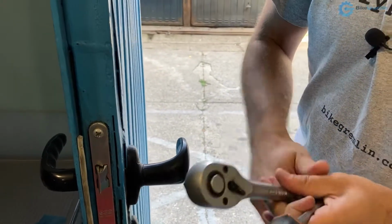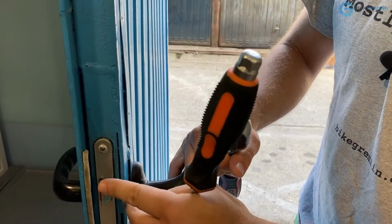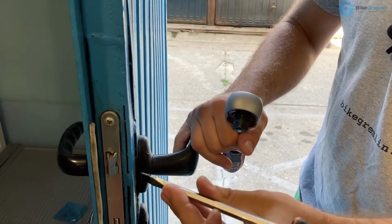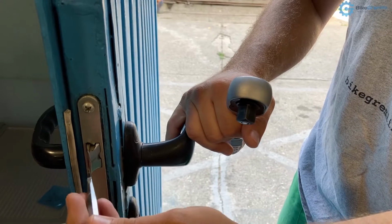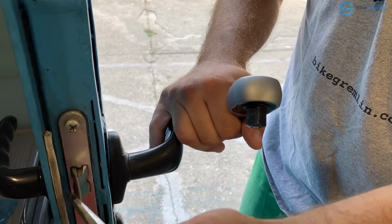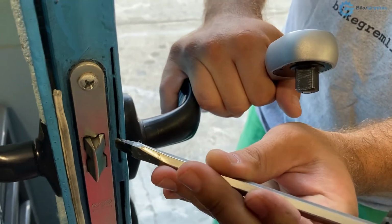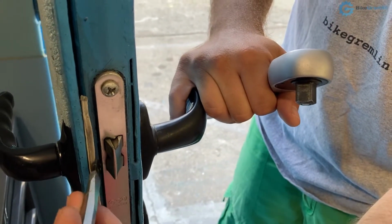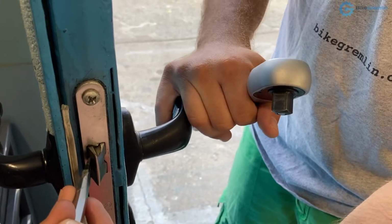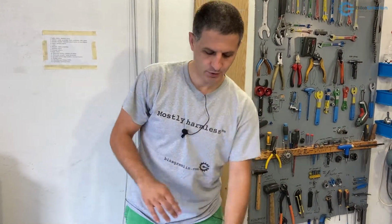When you use this switch, what you're basically doing is either turning this in the other direction or turning the thing that the ratchet catches onto by a different angle. For example, if I made this angle a bit like 45 degrees, this would work in the opposite direction. If I put it at 90 degrees or even the other side, it will stick. That's what happens inside here when you are doing this. So there are slight variations of how manufacturers manage to do this, but it's always basically the same principle.